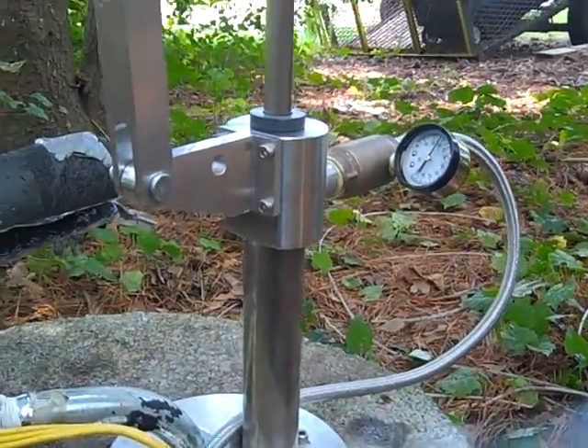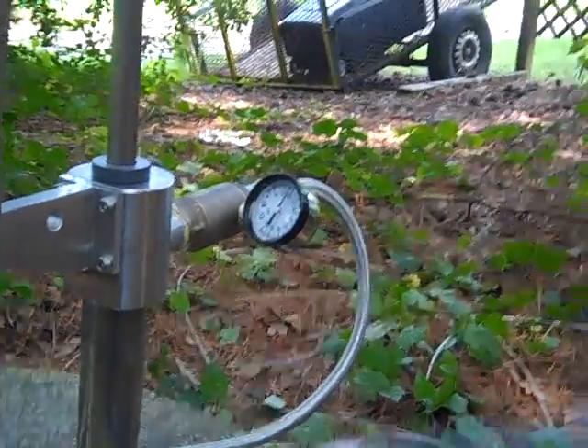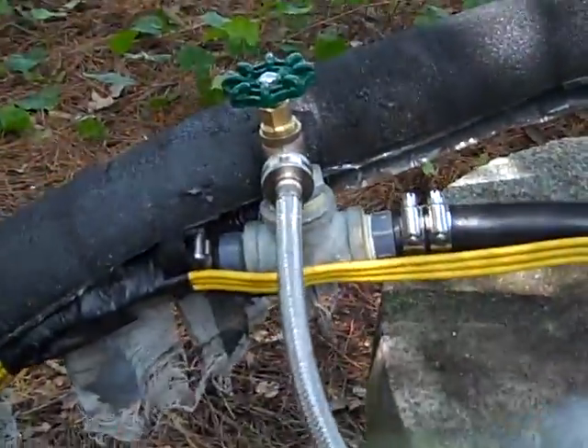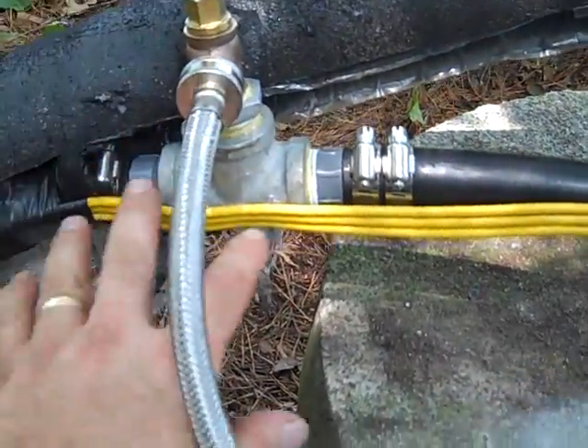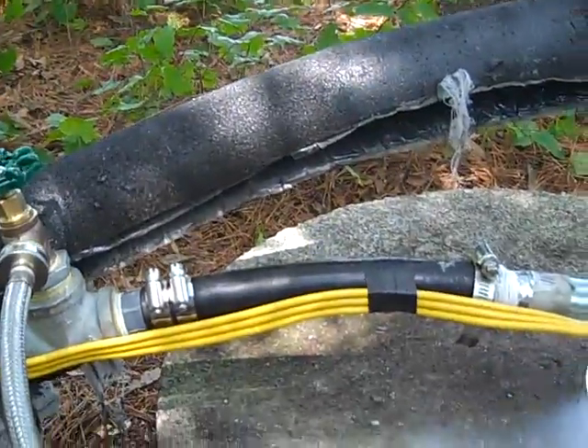What you end up doing with a Simple Pump — unlike any other pump out there, because I've looked at them all — this is the only pump that can back-feed and pressurize your home. When you pump with a Simple Pump, you actually push water in through your line. What we added here was a spigot hooked into his existing line to his home.